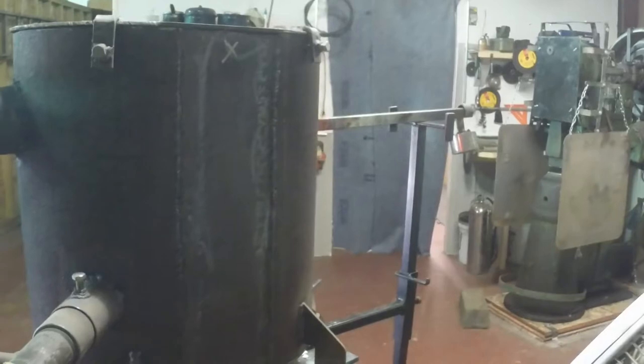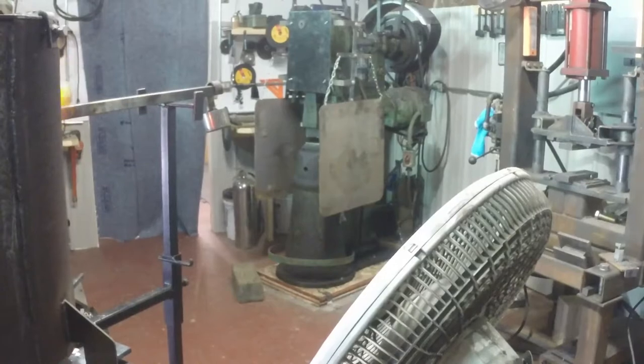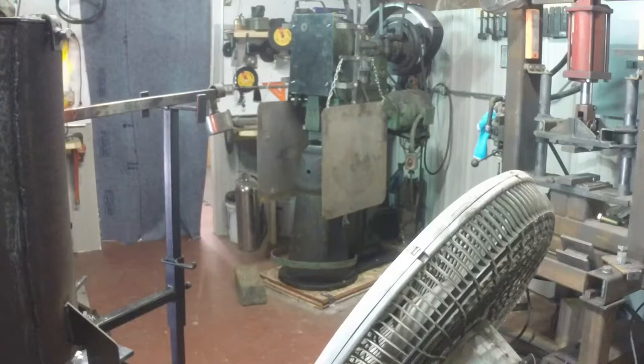Okay, right here off to my left is my forge with the steel in it. Over there is my power hammer. I'm going to come out of this forge with that billet of steel and go into that power hammer. Now, those two big sheets of steel you see on either side of the power hammer are shields that are going to stop the molten flux that's all over the billet from squirting all around the room. And see, I've got a drop cloth there over the door. This is a brand new shop, and I don't have a door in my finish room yet, because quite honestly I don't need it. But when winter gets here, I'm going to have to put a door in there for heat. But anyway, those big plates of steel there keep the flux from squirting all over the room.